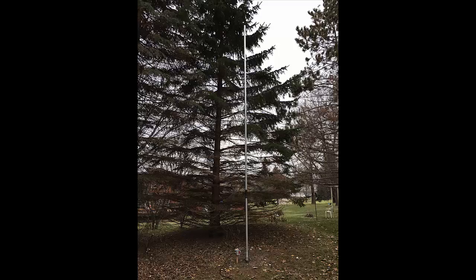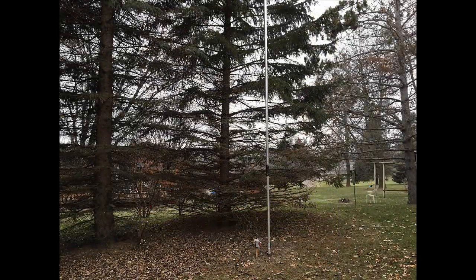This is FORCE12's flagpole antenna, however I just purchased the antenna without the flagpole accessories. I went with an off-center fed vertical dipole because I wasn't interested in laying out a second radial field for a vertical antenna. My intent was to find a general purpose antenna that I could use this winter, covering 4 bands — 20 meters and higher. So after reviewing the antennas that were available, I liked the specs and the reports that I'd heard about the FORCE12. I sent in my order and soon learned that one of the parts was on back order.